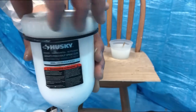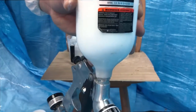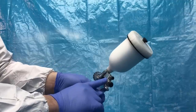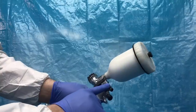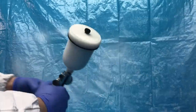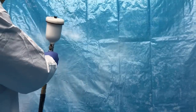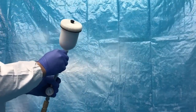Always make sure you put the cap on — if you don't, the paint's going to squirt up and make a mess. On the gun you have a couple of adjustments: this one controls how far your trigger goes back, fine-tuning how much paint comes out, and the top one is for coarsely adjusting paint flow. Check your pattern quickly against a tarp or a piece of cardboard before you start.